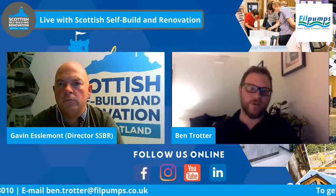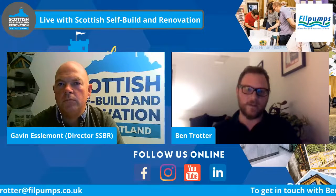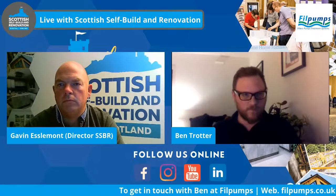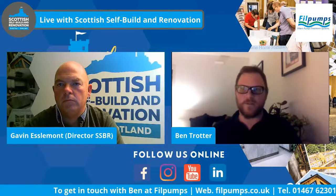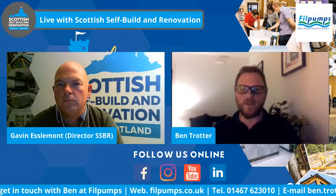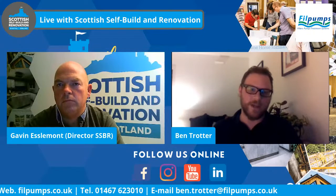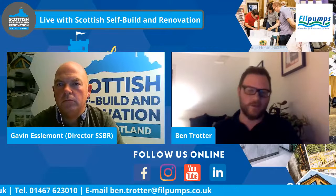And then when we do come out to have a look at it, it won't be a case of we'll just give it an inspection, change media, whatever. It'll be a case of, if that salt isn't topped up and the backwash doesn't work, the media won't get cleaned and it'll foul, and it won't last as long.